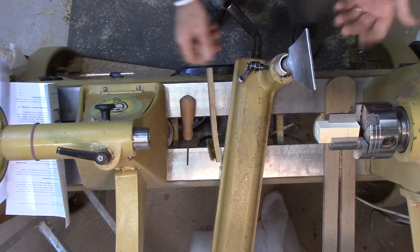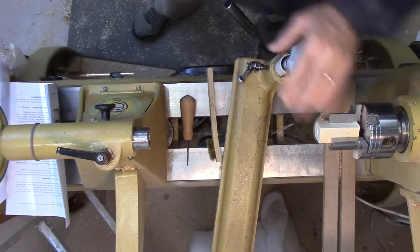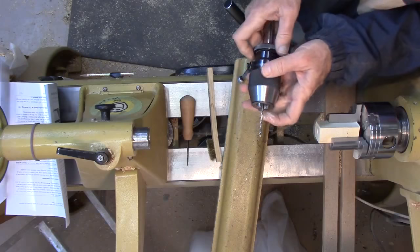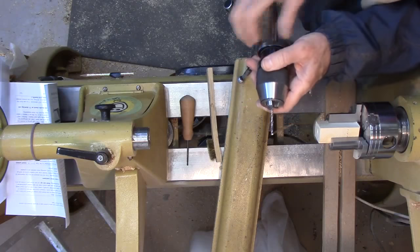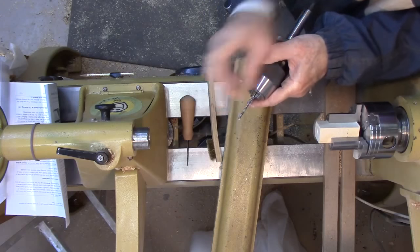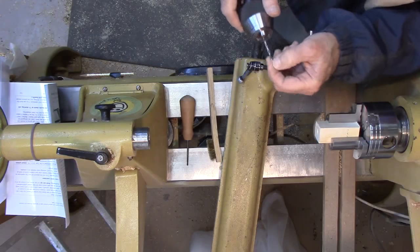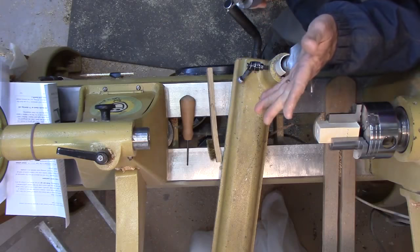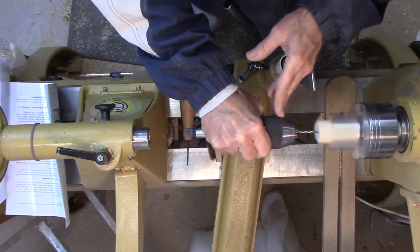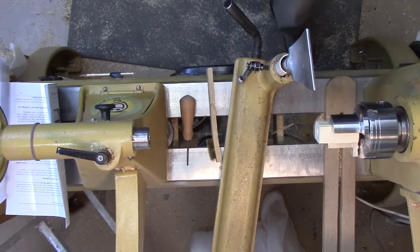Now that we've got it drilled out, we want to double-check that we've got a through hole. The problem with these little jobber bits is they'll only drill maybe two inches deep — this distance plus the half inch or so of the larger hole. So before you take it off the lathe to turn it, make sure you do have a through hole. The fastest way is to just go ahead and drill from the other side — that'll guarantee a through hole.